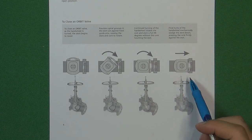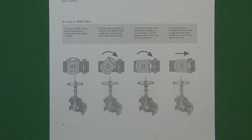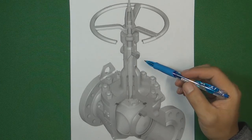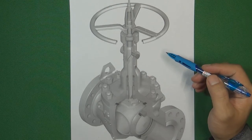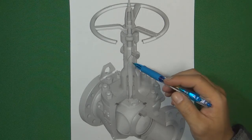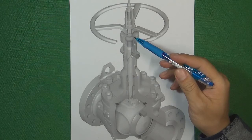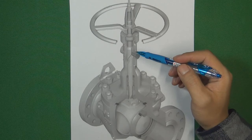Next, let's look at how the orbit ball valve achieves this special function. The orbit ball valve stem movement is very special compared with the original ball valve stem. The original ball valve stem movement is just an angle movement, traveling to 90 degrees and back to 0 degrees. But the orbit ball valve stem movement is not just turning — it also includes linear travel.